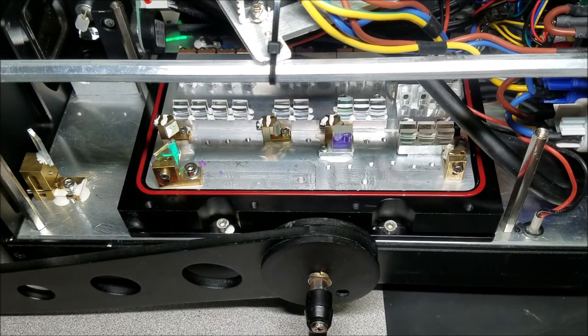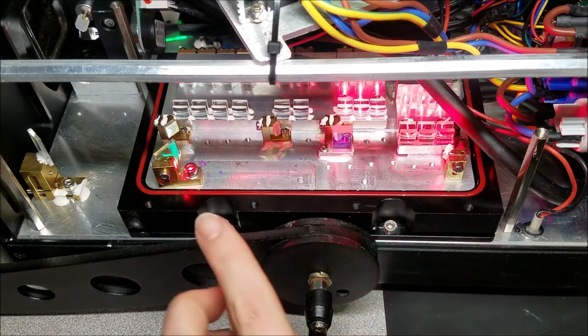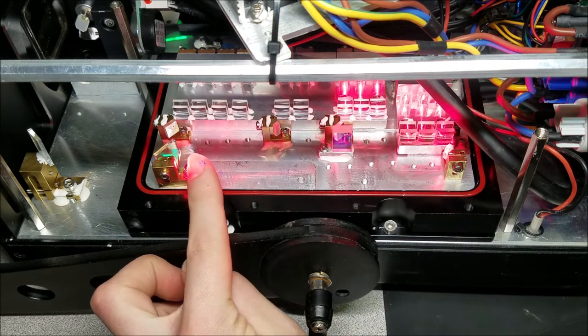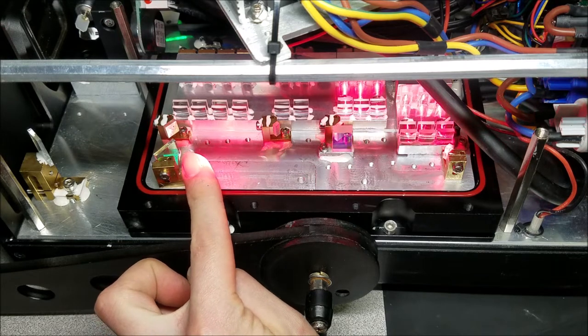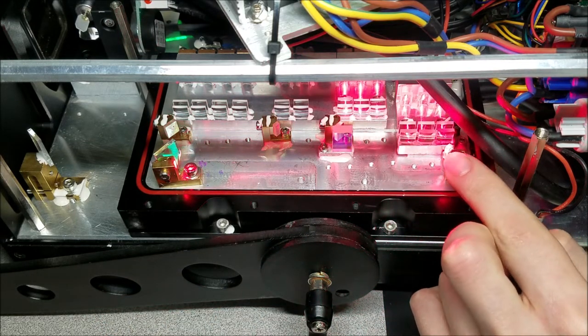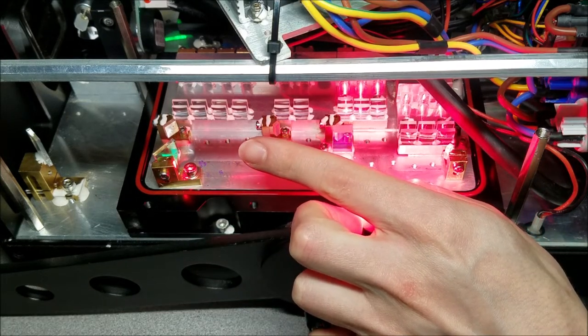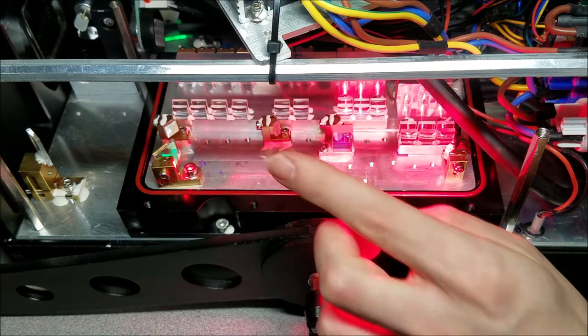All right. And it doesn't have to be perfect right now. As I said, we're just using it as a reference so we can take a look at some of the light as it travels through the laser. On. All right, so we can see that our output is actually hitting right here. So that means that the laser light coming from this laser is hitting that mirror. It's bouncing this way. So we need to move the optic this way. And it looks like we need to move the optic down a little bit.